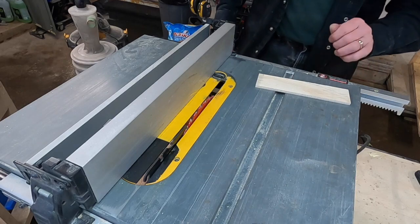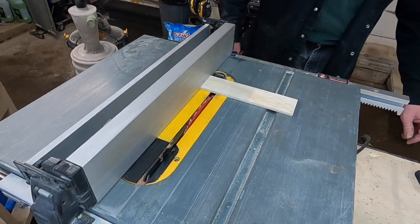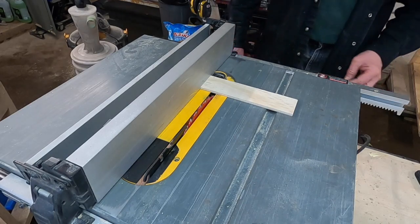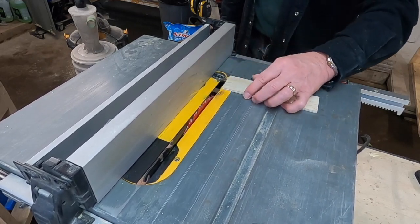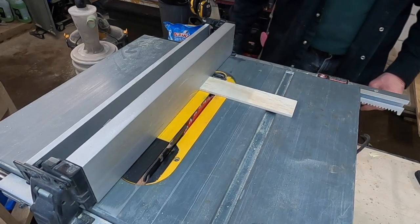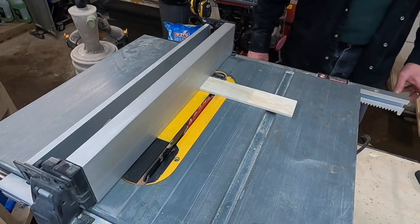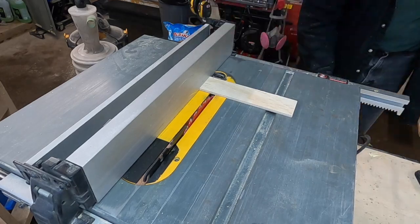Alright, what I decided to do was not to cut out the bird's beak, whatever. I decided not to cut them out. I decided just to inlay them. They're 2 inches wide, which this is, and it's going to be an inch. Each step will be an inch and a quarter, which this is set up to be. If the glue doesn't work, I'm just going to use hot glue and then shave off the rest. So here we go.